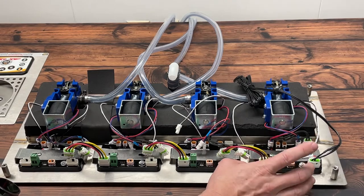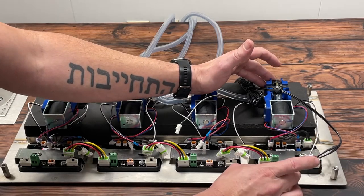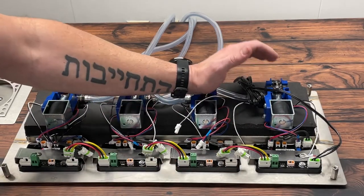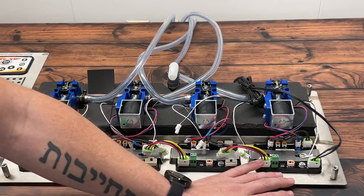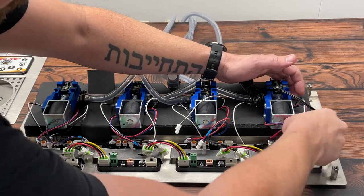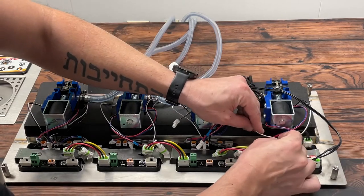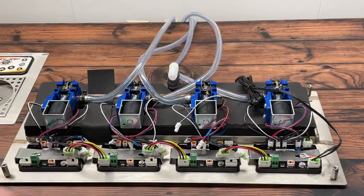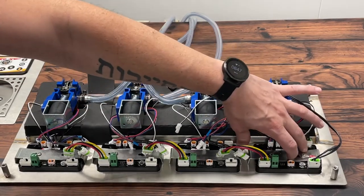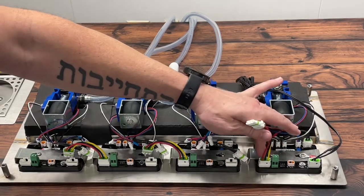At this point we can actually test whether or not the valve will open and close. With a keg untapped, you can put it in auto mode, put the cup coupler on there, and slide it down to check if the valve is opening or closing, all while making sure the circuit board stays powered up. Once that's done, plug the LEDs in one at a time, doing the same test to see if the LED light comes on, then plug in the last LED on that circuit board. Now we have this full valve assembly connected with all its sensor wires, and this circuit board alone is powered because we don't have the jumper connecting from one board to the next.